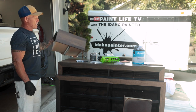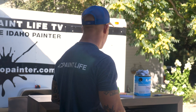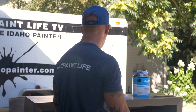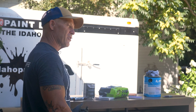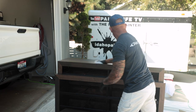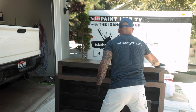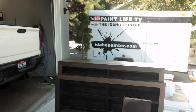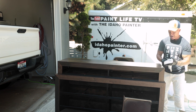We've got a dresser and a nightstand that had some big chunks of paper torn out of it, and we're going to fix those so you can't even see it. We're taking a dollar piece of furniture for my daughter — I'm going to turn it into $400 furniture and help her get to Ireland. The first step is to wipe the furniture down really good with a crocodile cloth so I don't have any contaminants and don't cause fish eye when clear coating it.